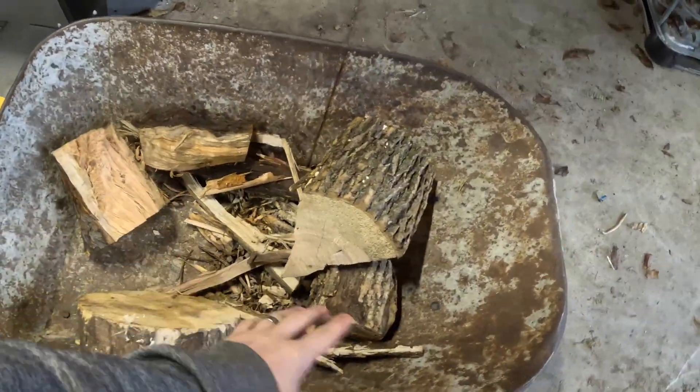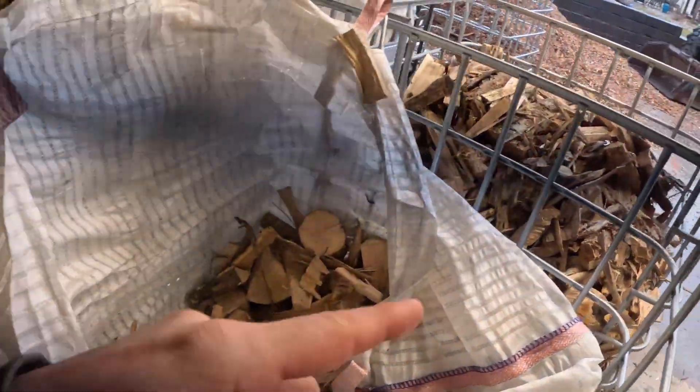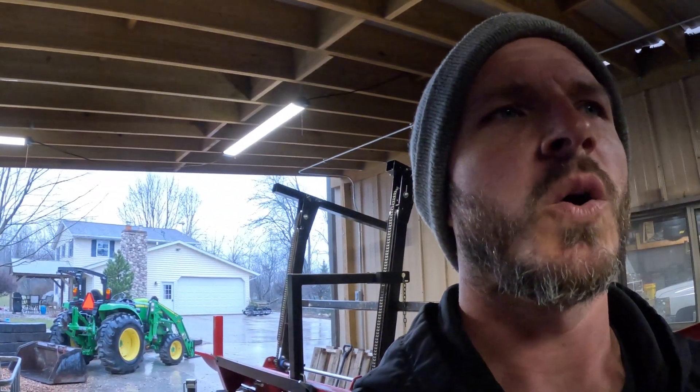Since I've been burning a lot of this kiln-dried wood — all of it was in the kiln for three or four days — a lot of it's smaller stuff but it's all virtually zero percent moisture. It's probably regaining a little bit being out in this wet environment, but when I go into the firebox the next day I can kind of tell — I don't know if it's because of how dry the wood is — but the creosote that built up on the walls is actually kind of going away.